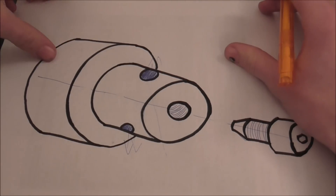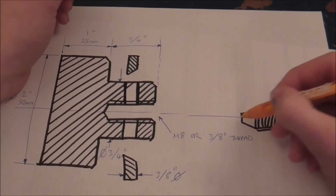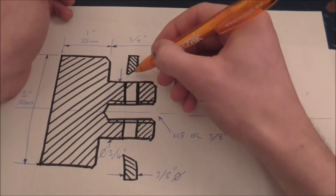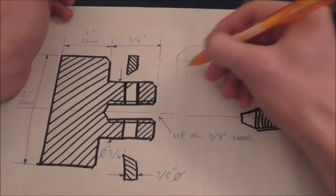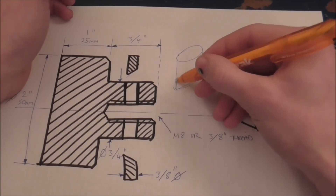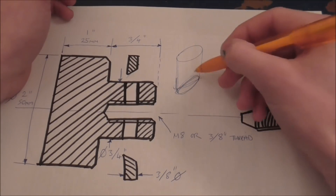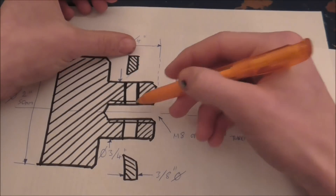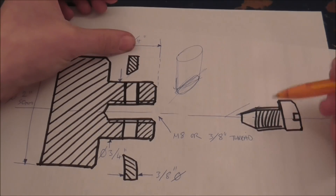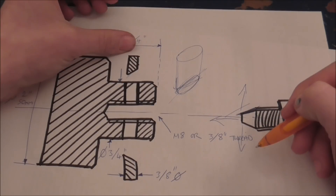So we'll have a look at another drawing. Here's my other sketch — I'll just point out this mechanism. We've got a taper on the end of the bolt, and the only part you can't really see from the outside is the end of these plugs. If we imagine them in 3D, they're round and on the bottom I cut an angle. You've got a round plug with an angled face at the bottom, and that angle should match the angle of the machined taper. So when this pushes inwards, the plug goes upwards — that's happening on both sides and that is what causes the locking effect.